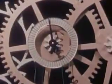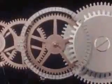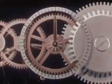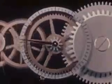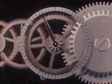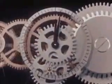As the gear train of a watch moves far enough to make five ticks of the escapement, the second hand moves one graduation on its dial. To count the minutes, we can attach a dial and fasten a pointer to this gear wheel, which is just the right size so that it turns one complete revolution while the second hand makes 60 revolutions. And to count the hours, we can have another pointer geared just so, to move one complete revolution every twelve hours.